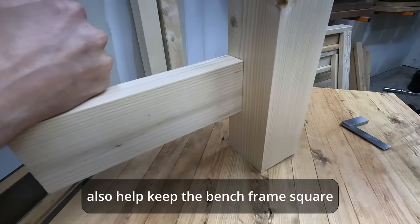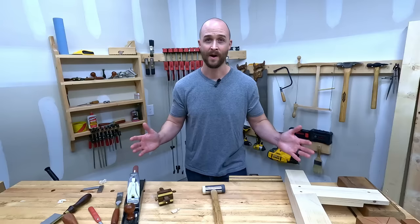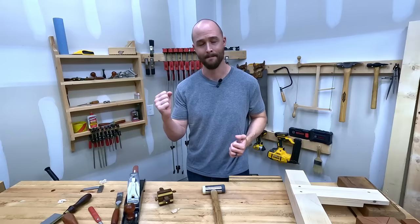This is a big step up from just bolted together. It's a half lap or a cross lap joint. Mix in a little glue and some nails or screws and you've got a seriously good workbench joint. Honestly, I rarely ever use half laps because with hardly any extra effort, you can get a mega payoff and totally kick this thing into overdrive.